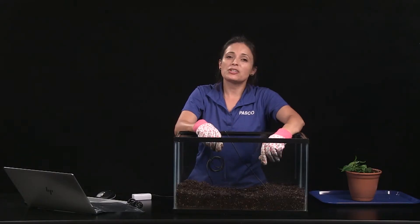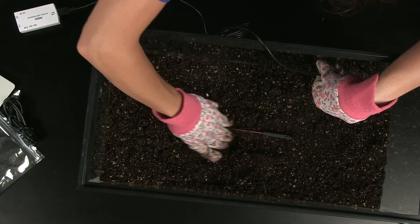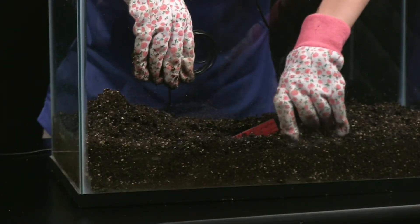Compact to the natural compaction and take the soil measurement. When you're done taking the soil measurement, avoid pulling the probe by the cord. You want to carefully unearth the probe to remove it, like this.